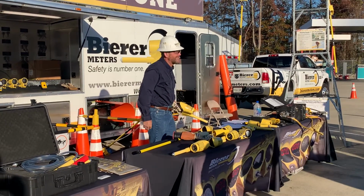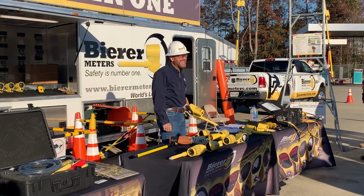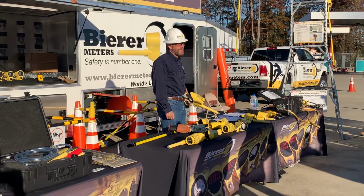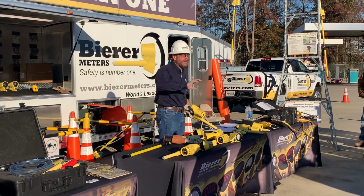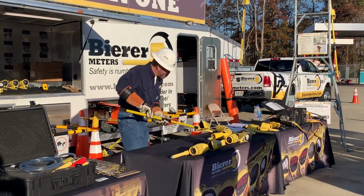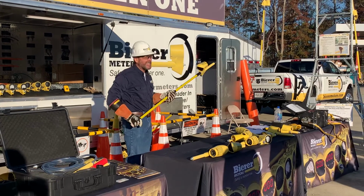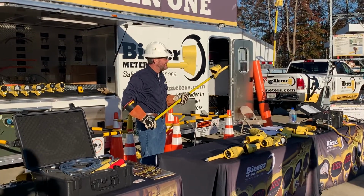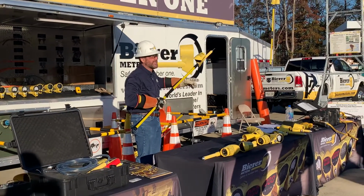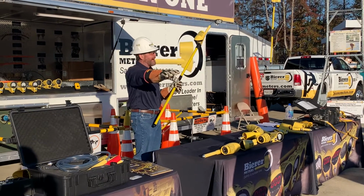A lot of arc flashes are taking place. I do a lot of post-incident training, and I don't like the post-incident training. I don't like that at all. I like pre, because it never happens. When you use your gloves, stay back away from your meter head, like this. You're going to get accurate readings, very accurate, because you're away from how that tool works, functions. You want it to go to the ground plane, not to you guys as ground planes.